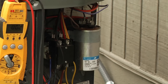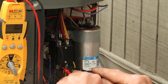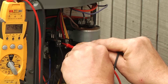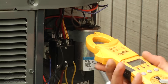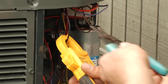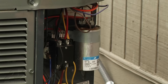Then we're going to go ahead and power the unit up and check the volts on it. Set the meter to volts and read the incoming power, which is 248. We're going to make sure we don't have any loss across the contacts — we're good there. You can read the motor and the compressor amps — it's at 4.8. You can read both legs the same way. Making sure we don't get electrocuted, just going to reach in there with some insulated wire. Read the fan — it's at 9 tenths of an amp. All the specs are on the other side of the unit where you can actually verify when it should be at high or low amps.